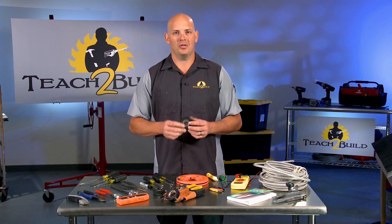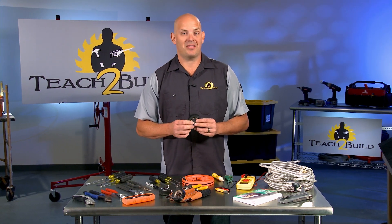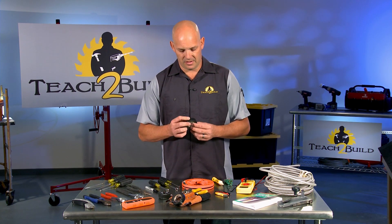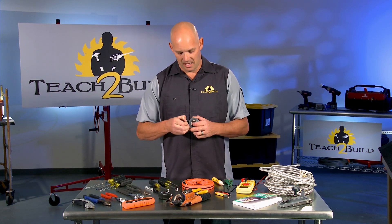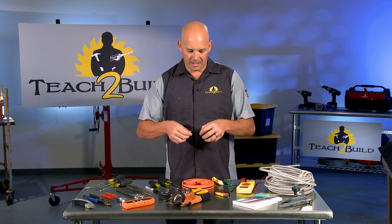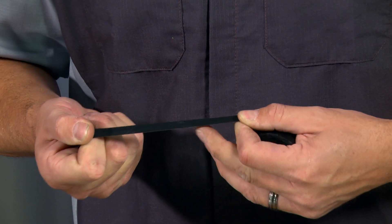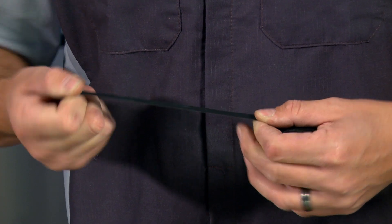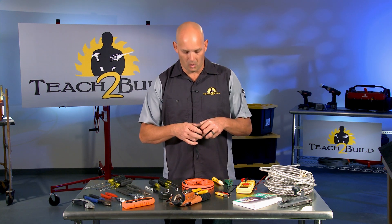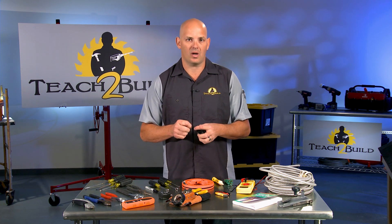Basic electrical tape — you get what you pay for. I won't pay $6 for a roll, but I will pay $3 to $3.50, and I will never buy a roll for $1 or less. There are things about quality tape that make them dramatically different. Electrical tape becomes a waterproof application when it's stretched far enough that it begins to change color to a light gray — that means you've stretched it enough for great adhesion and water resistance.